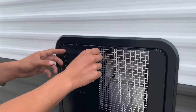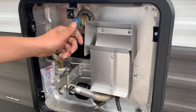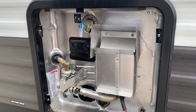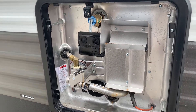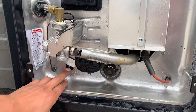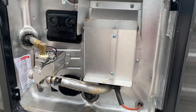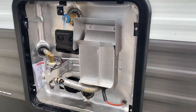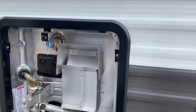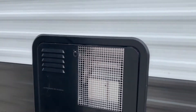Your hot water tank right here. This key way — just line that up, it pops open. Pull it up and it's out of your way. Before you ever turn it on, the controls are just inside. Before you turn it on, you want to hit that relief valve right there and make sure a bit of water comes out. That water coming out is just letting you know that it is full and safe to fire it up. Bottom left corner is your electric switch — just turn that on, it turns on the hot water tank with electricity. Propane is just inside and the reset button is just this one on the right there. Line up those two holes in the fins, put it back in place and there you go.